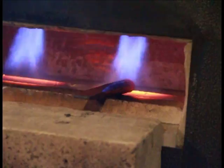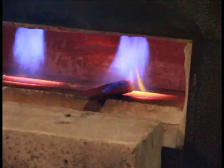To normalize the steel, we want to bring it up to the point of magnetic transition, where the magnet no longer sticks to the steel. However, we want to bring it just to that point — so we're not talking bright, hot, yellow, orange — we're actually below forging temperature. We want just enough so that it reaches the austenitic transformation, i.e. the magnet no longer sticks.